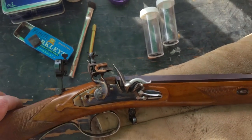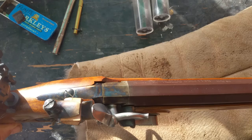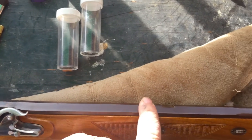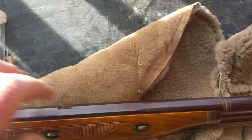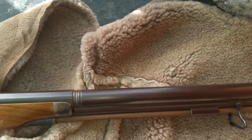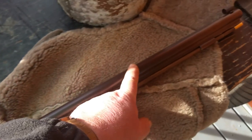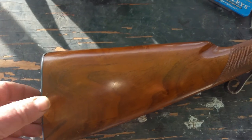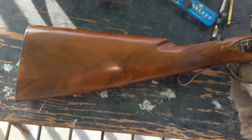Let's look at the barrel. The case colour-hardened piece there is the end of the barrel, known as the breech, and that contains the chamber where the powder is ignited. This is an octagonal shape, then we go along to a 16-sided section, and then further along the barrel is round with a wedding band transition. This gives strength at the combustion chamber end and lightness at the muzzle, which helps the balance of the gun. The stock is a shotgun-style stock which fires from the shoulder.